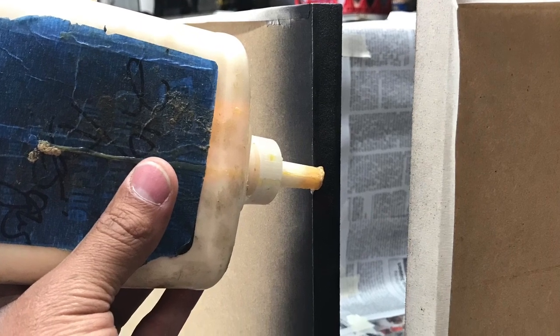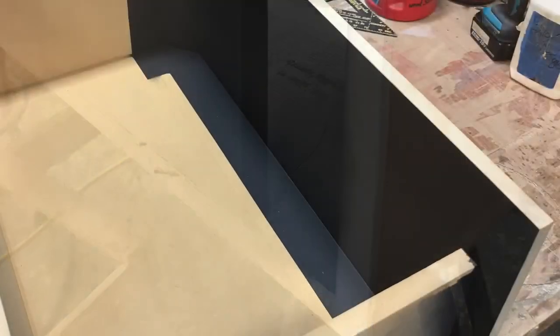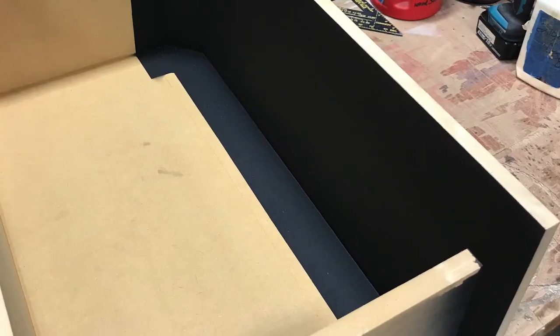I'm adding a thin layer of glue — you can see it, parts are lighter and darker. Hit it with that and then I hit it with the paint and it stopped all that absorption. So: a thin layer of glue, let it dry, sand — it'll stop all that absorption.